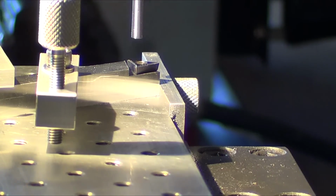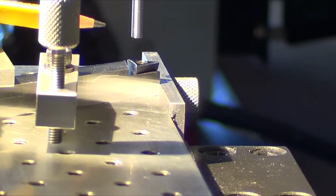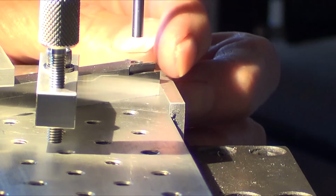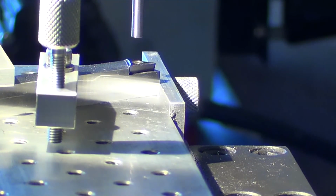Okay, I've got the holder back in the clamp back down on the mini pallet. Now, this is what I tuned into, why that hole is off, or why I had screwed up three of them. The height of every insert, even though they're the same quarter inch IC, is different between all the inserts, and the angle on the face of it, which is the relief angle, is different on all the inserts. So that impacts where this guy is going to hit the edge here to have the backing on it for cutting.